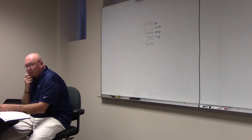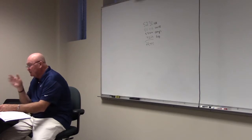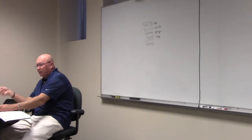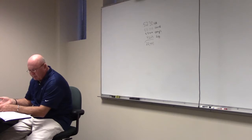Maybe they weren't wrong. Read the rule. Full load current. The full load current, the largest one we had was actually 13.8 amps, 8 amps, and 7.2 amps. Do you understand what it's saying there, guys? Even though the volt amps is more for the other one, the current is more for the smaller one. And so that's the reason we choose the 13.8 amp one. Can you see that, James?